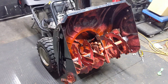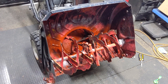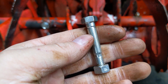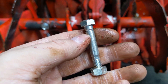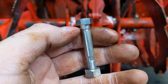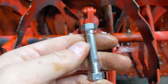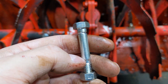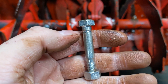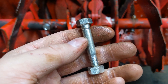I can link a two-part video in the top right that takes you through all the steps: separating the auger housing, complete disassembly, replacing parts, reassembly, and the snowblower working again at the end. Getting back to the main focus — the shear bolt. You not only want to make sure you're running a shear bolt to begin with, but also the proper one, meaning the weak points are at the correct position. If you have a one-inch inner shaft on your auger assembly, you'd want a shear bolt with those cutouts one inch apart, so both sides shear cleanly when the auger fin jams.